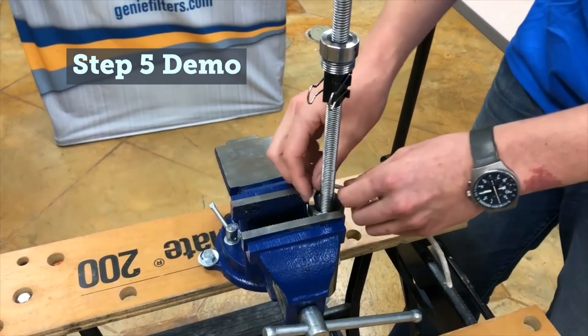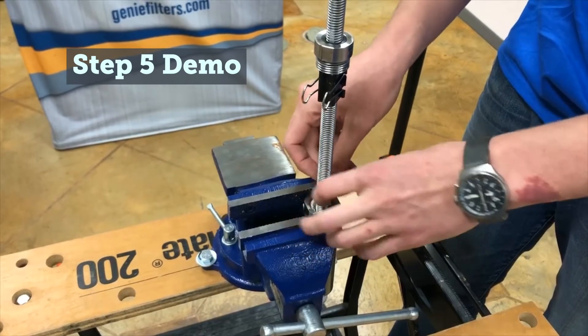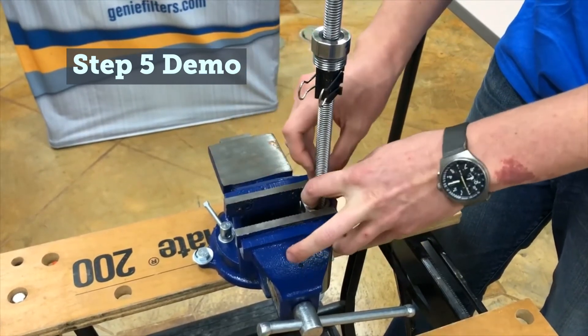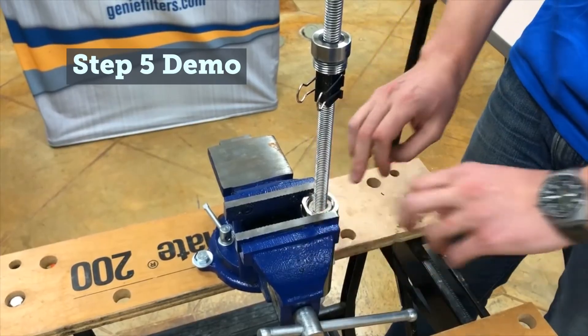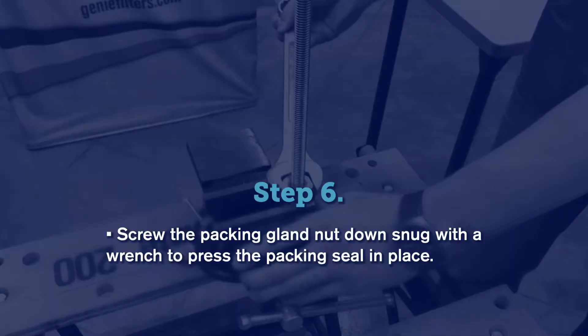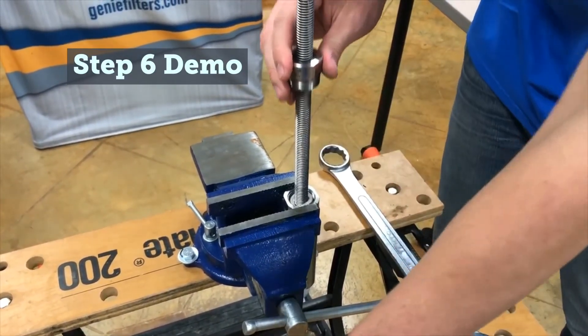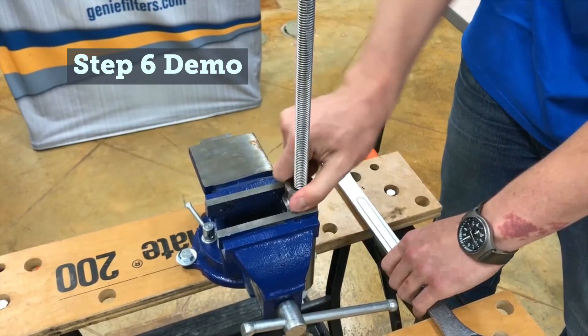Locate the new piece of packing rope from the Packing Gland Seal Kit. Install the new packing rope into the gland in a clockwise fashion, gently tapping it down as you go, being careful not to damage the packing. Temporarily remove the binder clip and use your one and three-sixteenths or adjustable wrench to thread the Packing Gland Nut into the gland, using it as a means to drive and form the Packing Rope into the gland.